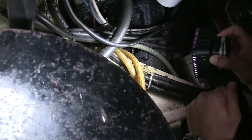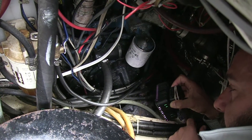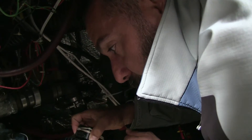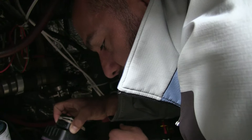When the engine is cranking over, it should easily avoid nuisance tripping on that fuse. The advantage of installing one on an older boat is that if the starter ever gets stuck, or there's a dead short from the starter to the engine — which is common — you're not going to have a fire.